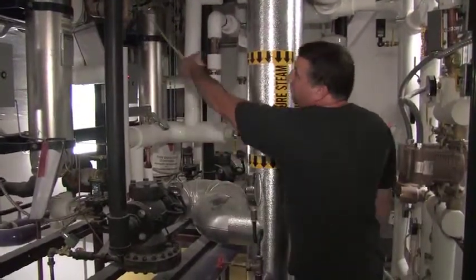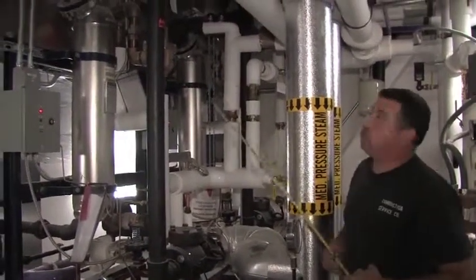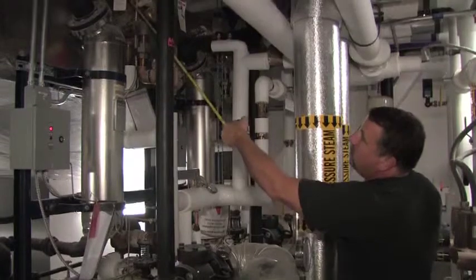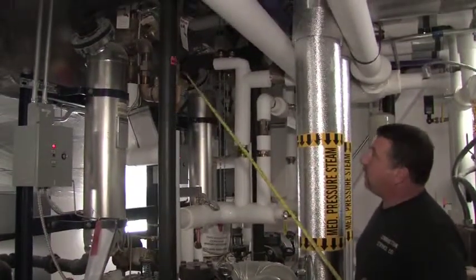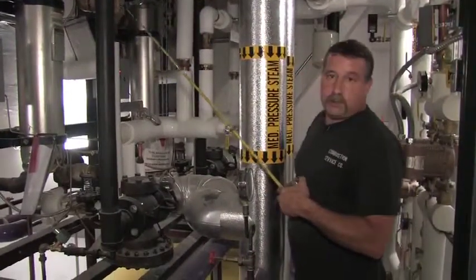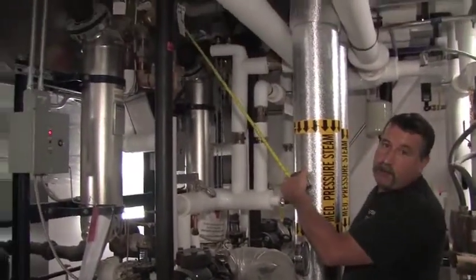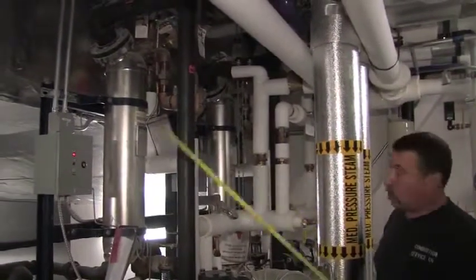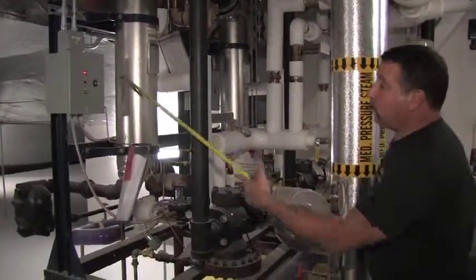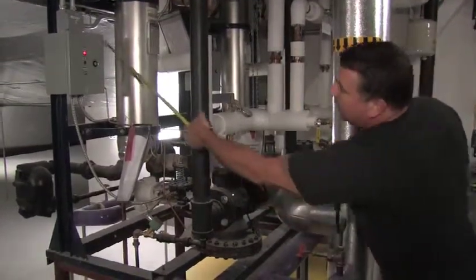So we leave the second stage blending valve. There's a gauge letting us know what our outlet temperature is, right up at the top of the unit. We have primary and secondary aquastats that are functioning only as a safety. If we should have any high limit temperatures, 15 degrees over the set points on these blending valves, these will trip. They will close this fast acting solenoid valve and stop hot water flow out of the unit, so there's no scald issues.